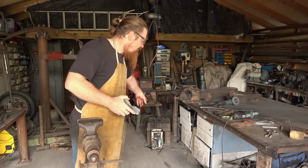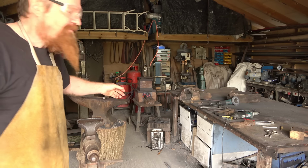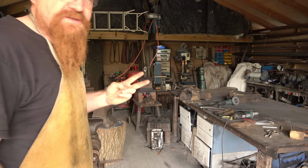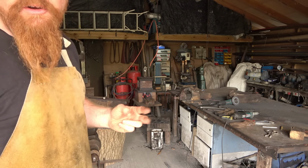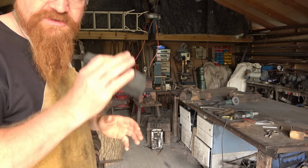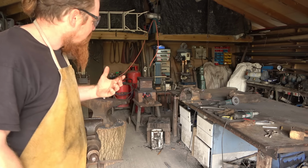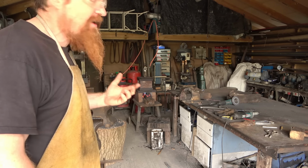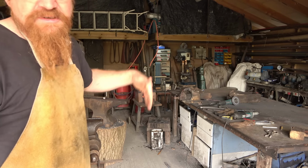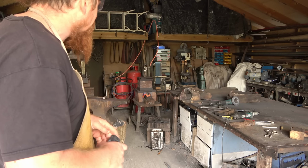In front of the forge there, there's my usual tub of olive oil. Inside of the forge, as it's coming up to temperature, I've just put a piece of angle iron, and I'm going to pull that angle iron out, stick it in the oil, and just pre-warm the oil. There's two reasons for that, or two that I can think of. One is that raising the temperature of the oil makes less of a temperature shock when this goes in there. Secondly, it makes it much more runny, which both of those are much more pertinent things in the winter, because this olive oil actually goes solid when it's properly cold. So I'm just going to warm that up until it's too hot to leave my hand in there, which I'm guessing is about 45 degrees, something like that.